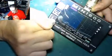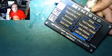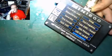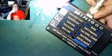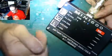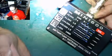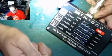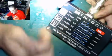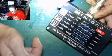I mean, this thing can do so many things. I was only going to explain to you the ones that I've got, which is those 3 and that broken MFJ, and then I thought I'll pinch this off James and just give you a quick look at it. But it can do all kinds of interesting stuff, like multi SWR. I've got it on this antenna at the moment, and it's checking it out. That's on 2 meters, 70 centimeters, no problem at all.